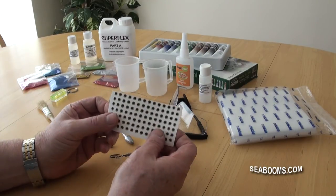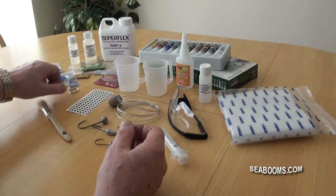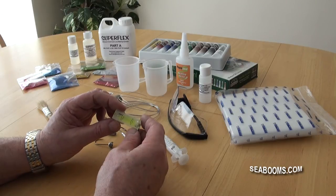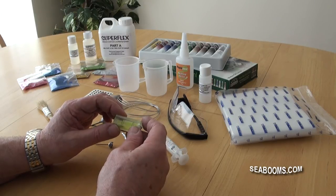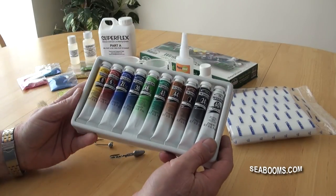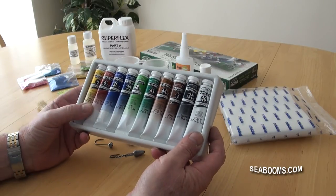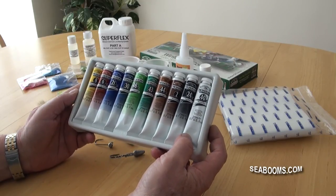There's a range of 3D eyes in different sizes and colours, up to 10mm. There's a useful little gadget - a lure level, ideal for checking the level of the table and worktop, making sure your level is correct on the mould so you don't get a slop over, because the silicon will find its own level and will start to run out if it's dreadfully out of level. For colours, you've got quite a range to select from - that particular package will create virtually every colour that you're likely to need for lures. Two sizes: 21ml and a 37ml tube, and they will last a long time because you need very little - the silicon accepts colour very, very well.